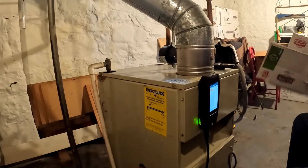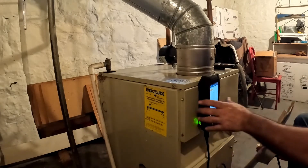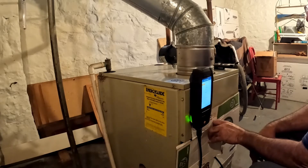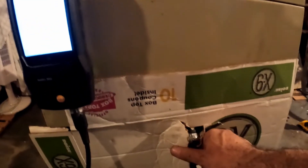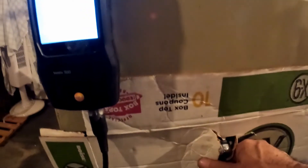The carbon monoxide is high so we're going to see what's going on. The carbon monoxide is coming down because the draft box is being covered - the dilution air is being misdirected. So right now what I'm doing is forcing the air to go from the bottom instead of going into the draft box. Apparently there's no positive pressure - it's negative pressure in here.